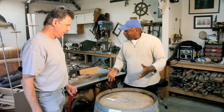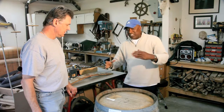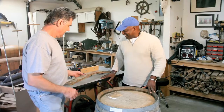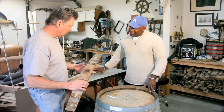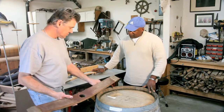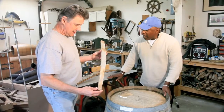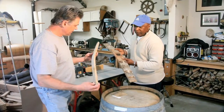Peter, we were talking about the shape of the drum. Now, would you already have to steam this drum, or is it already steamed? No, this is already steamed. It's all bent. It's ready to go. Actually, this is a stave out of this. Can't use this because of the hole. But I start with pieces like this. I cut them off here and here, the notches where that goes. And then reshape them into a shape like this. Wow. Simply from this? Yeah. So these go on the saw. I reshape them.